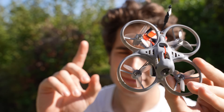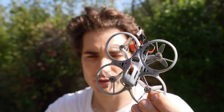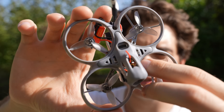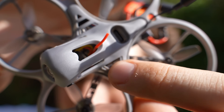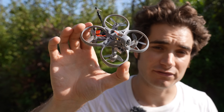We usually use brushless motors because they are a little bit more powerful, but these motors are quite big so I believe it's gonna be able to do a little bit of freestyle as well. The nice thing about brushed motors is they're cheaper — it's a cheaper kit — but also cheaper for you to replace. You can buy packs on Amazon and just swap them very easily because it's just a wire connected by a plug inside the main board, so you don't even need to solder anything. It's gonna be easy for beginners.